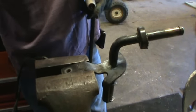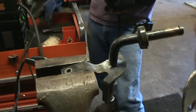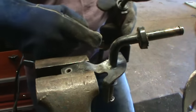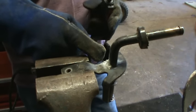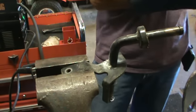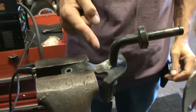I've got spiders in my helmet. My current is not high enough — I'm on low. Let's show you guys: I've got a gumball weld here. So I'm going to pause the camera, cut that or grind that off, because I know I didn't get any penetration. Then I'll be right back.